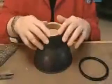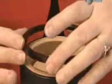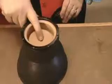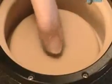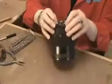The technician spray paints the metal compass bowl black, and pops a rubber diaphragm onto it. A bronze ring will hold it in place. This flexible rubber liner will contain the compass fluid and allow it to expand and contract. The dial and gimbal setup are then snapped onto the bowl.